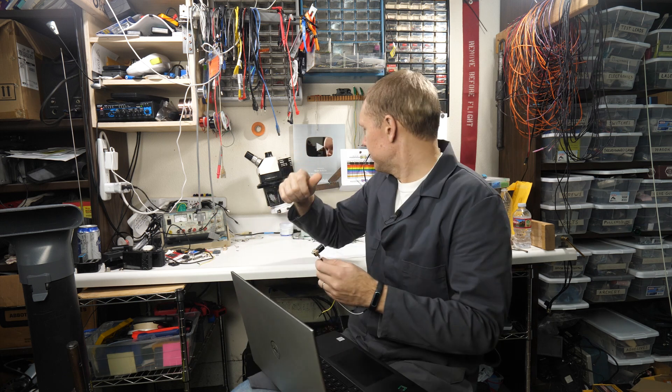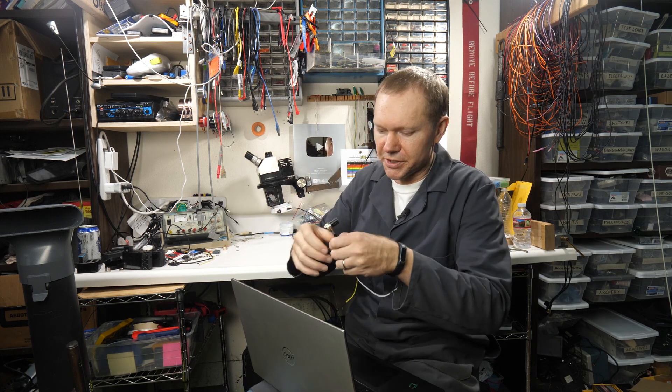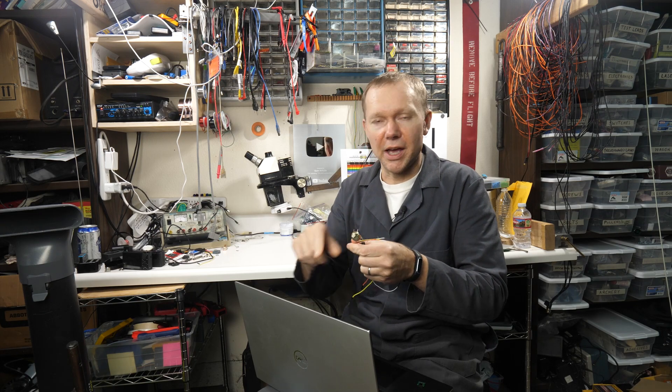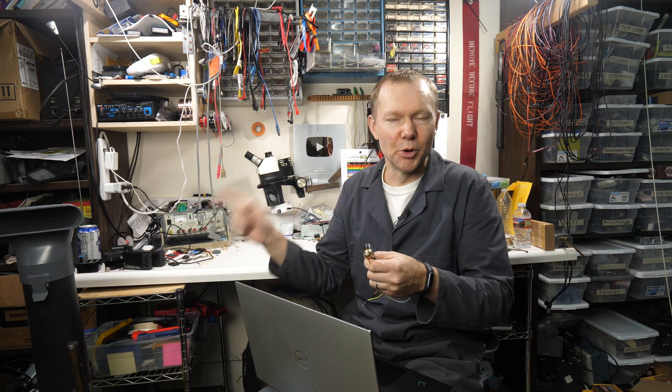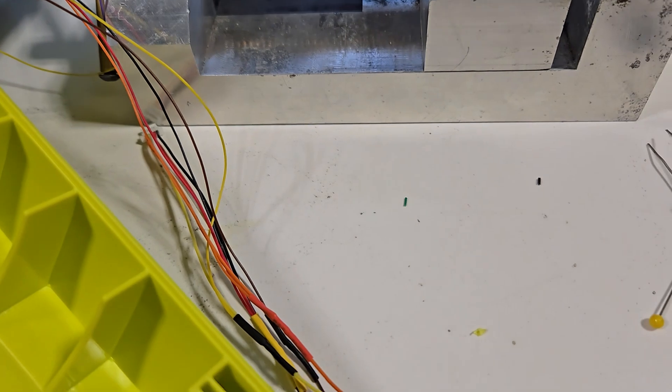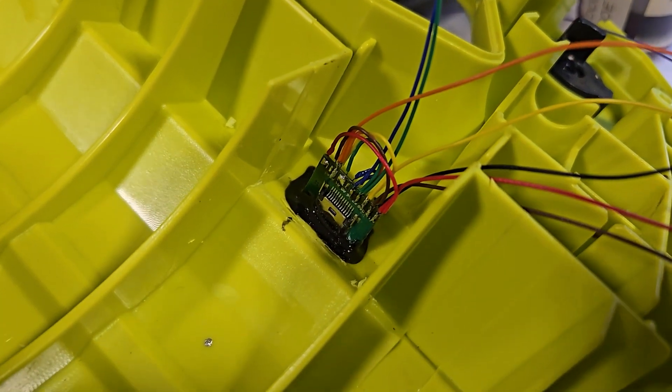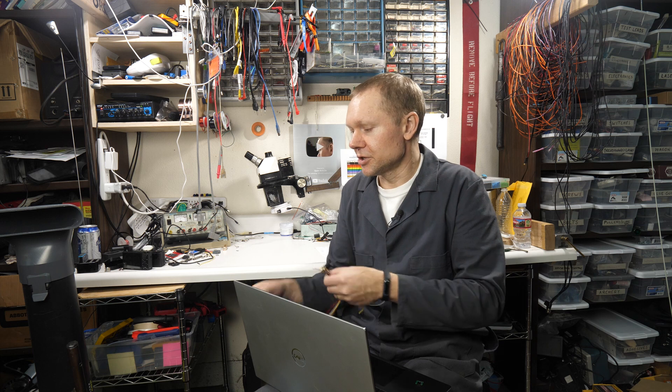To fix it, I bought a variety pack of cables off Amazon — this style plug was the right one. I wired this into the halfway point on the cable that goes from the motor controller to the throttle switch, stripped it back, soldered it, and put heat shrink tubing on there. That gave me a separate connector that came out to the USB breakout. Because I made a nice plug-in point, I was able to just open the leaf blower back up, unplug from the throttle switch, and everything works just fine with my remote control via the USB plug.